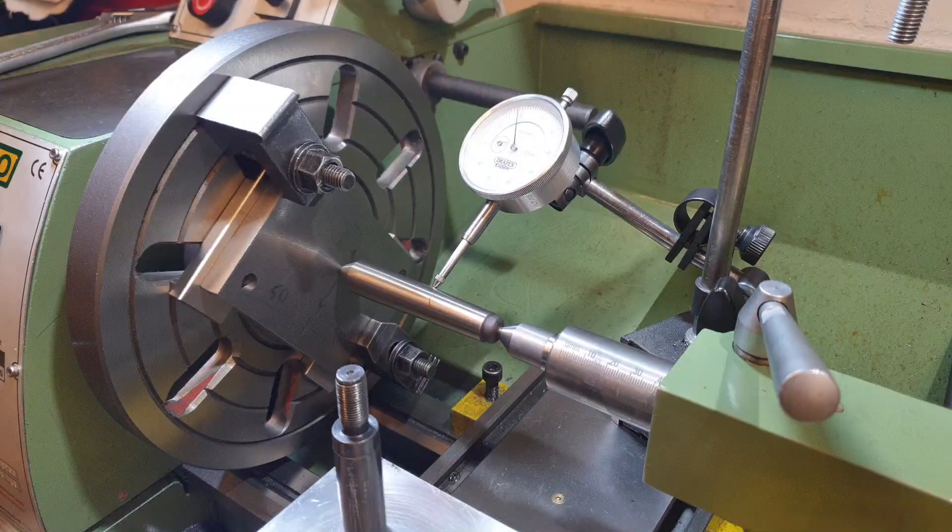My original intent was to hold the workpiece in the four jaw chuck, but I realised that one of the jaws actually coincides with the little breakout window needed to give visibility for the scale when it's fitted back onto the top slide. I did try positioning it with some parallels to lift the workpiece away from the chuck, but felt that was quite a precarious arrangement. So instead I've gone for using the faceplate and clamping the workpiece with a couple of parallels behind it to lift off the baseplate.